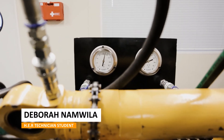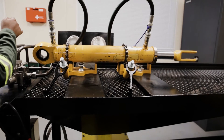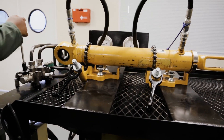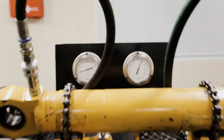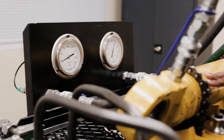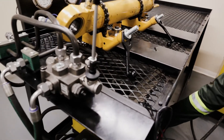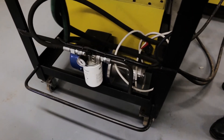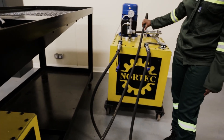Then we will have to do retraction. As you can see, when the piston rod reaches its maximum retraction, the pressure will also build up. Now, when servicing this cylinder, hydraulic fluid falls into the reservoir, which is here, and later on is picked up by the scavenging pump, back to the reservoir through this line.